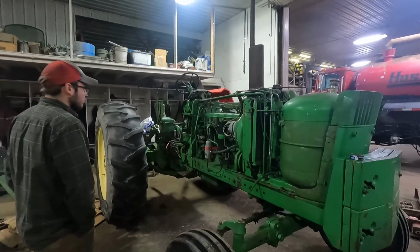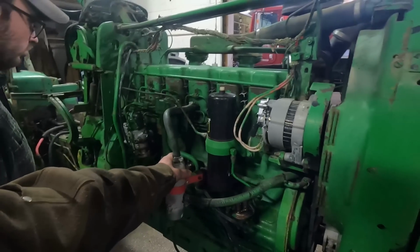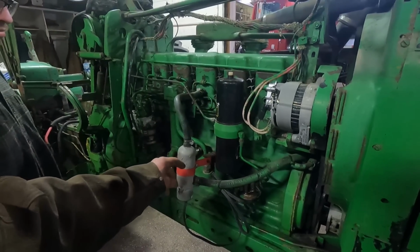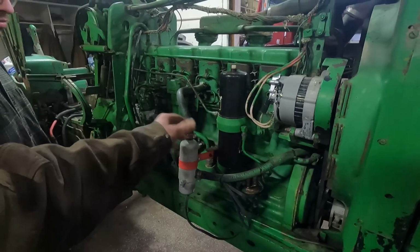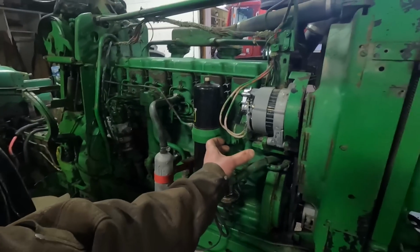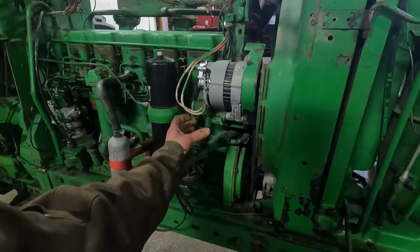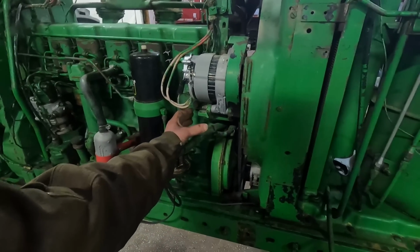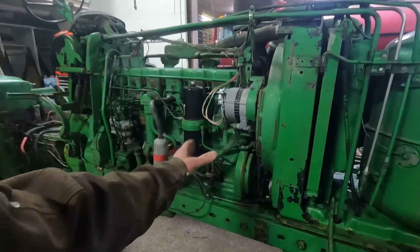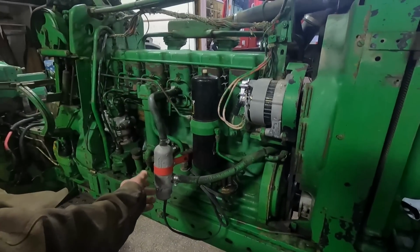So we're going to slowly get this thing put together. We need to rip this block heater off in there, which it's not really called a block heater. All that had is a heater element down inside it, kind of like what you would see inside a water heater. The authentic one was somewhat designed like this one, but it was a cast housing that bolted off of the air cleaner housing here, and I wish I kept that, but we had so many problems with that back in the day that we could not keep that going, and I just ended up putting these aftermarket ones on.